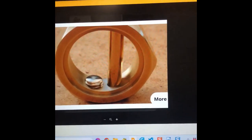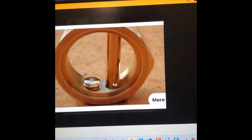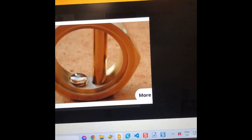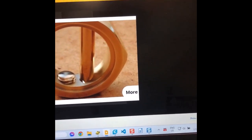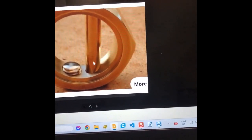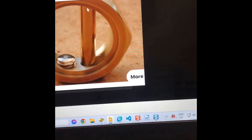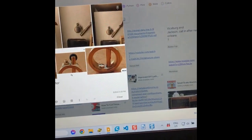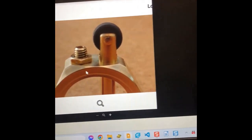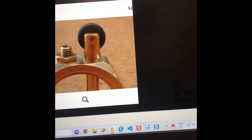I've had a look online and these are some more modern ones which are also penny lighters. I think here you can see the filler cap, or the internal view of the filler cap, for the lighter fluid. And this is the tube which the flint goes in. There's a screw at the bottom and I think a spring in here which adjusts the tension of the flint. This is what it looks like on the surface — this is for the wick to come out. And this is the tube with the flint underneath and the striking wheel on top.